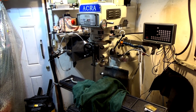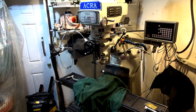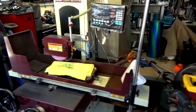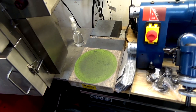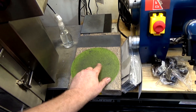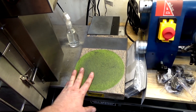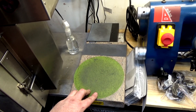Hi and welcome. This time I'm going to make some tools to make things flat, but that's a little ambiguous because almost everything in the machine shop is to make something flat or parallel — starting with the milling machine, the lathe, even the bandsaw. For more precision we have the surface grinder, and when things are small we have sandpaper on a surface plate. This is 3M adhesive abrasive paper: 30 micron, 15 micron, and 3 micron, on surface plates. But if you want to go a step better than this, you need a lapping plate.